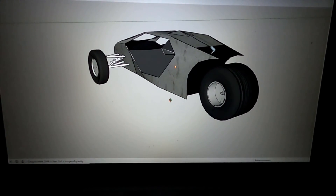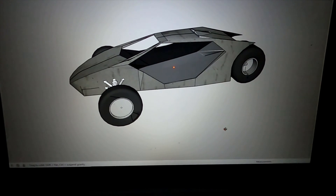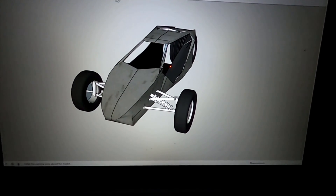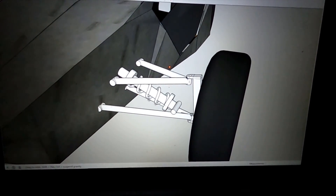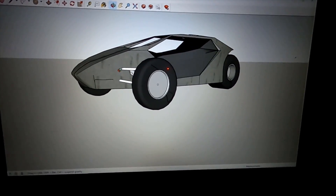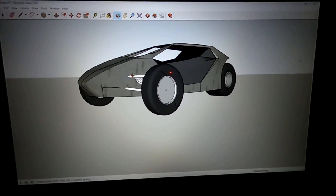So I'm back home now - I've been drawing up on the computer. For those who haven't been watching the other videos, I'm going to use a TL1000 motor and it's going to take up pretty much the whole back half here. I've been drawing up the front suspension - this is what it's going to look like. I even drew a spring, pretty proud of myself about that. I'm going to have it on quite a steep angle so you get more travel for a smaller spring, and I might use four-drive tires for the front - so it's going to be strictly off-road, non-tilting. It might be a little bit higher than I've got drawn here.